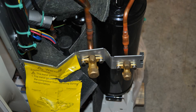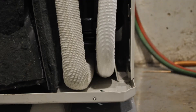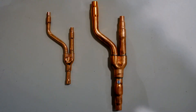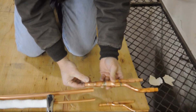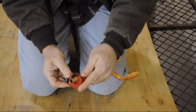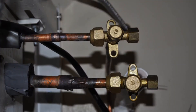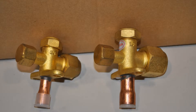Now we are ready to connect the tubing from the outdoor unit to the distribution boxes. The connection points of the condensing unit are three-quarter and three-eighth inch flare connections. We chose to have our line set exit the unit from the rear and fed it under the raised compressor mounting base. The piping from the condensing unit feeds into branch dividers before going to the distribution boxes. The branch dividers are formed to accommodate several sizes of tubing — choose the tubing size you will be connecting to and cut the divider to the proper size. Properly prepare and braze the connections.